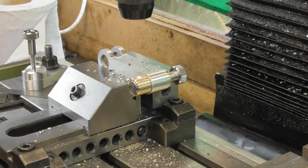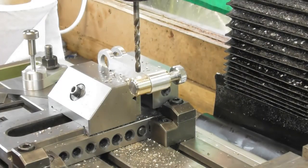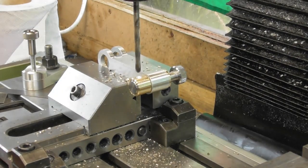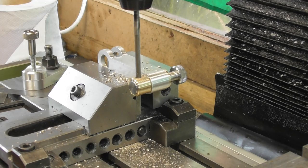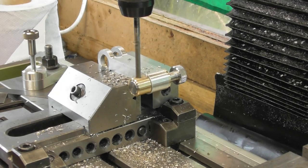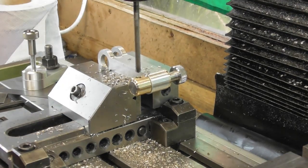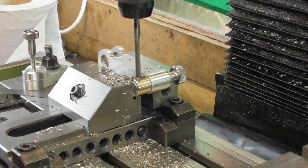I wonder if I was to put the probably 5mm drill first, I think. Let's go for a 5, shall we? Take that head up again. That'll do me. So I need to gently go right through with a 5mm drill. There we go. Let's have a little drop of fluid in there. That's better.